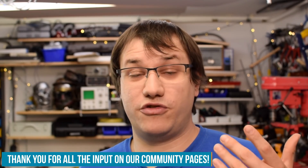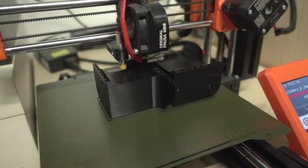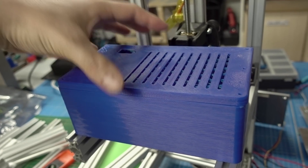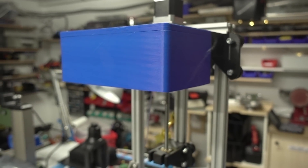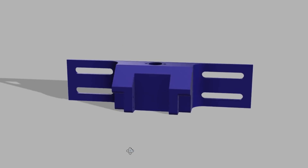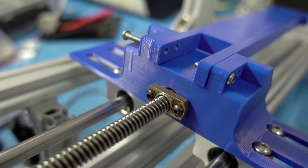I read all the responses on our videos, especially on the Element 14 community page, where people post insights and ideas for our projects. This 3D printer project got a lot of great contributions from the community, and I tried to take many of them in and simplify the design as much as possible. I'm using roller bearings on 2020 extrusion, but it turns out that's not good enough — mainly because I got the wrong extrusion. These roller bearings are meant to be used with V-slot and I got T-slot. That's wrong and it will never run smoothly.